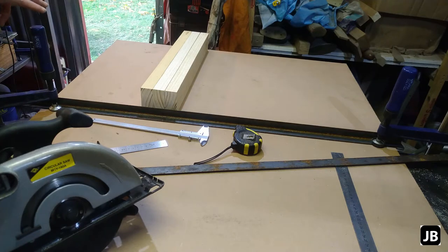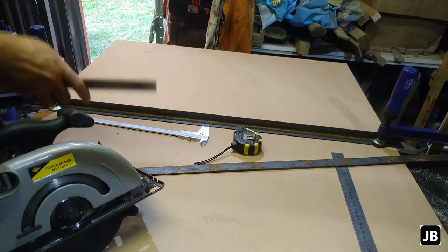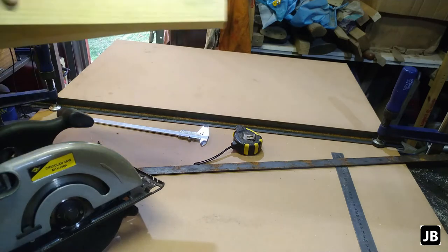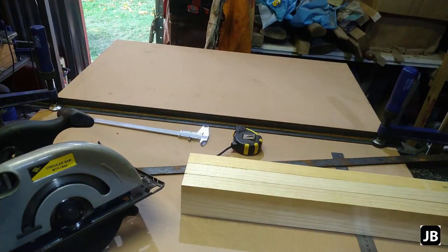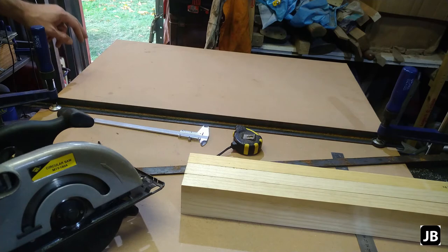What I've done is I've cut three pieces off. I think this is 75 by 30, 75 by 32 pine. That's going to be the end stop, so we'll get to that just now. But first I've clamped on a piece of angle iron here, measured it up, and I'm going to cut off this section because this is going to form the basis of our little jig. Eyes and ears — let's get into it.